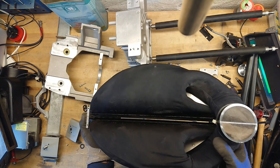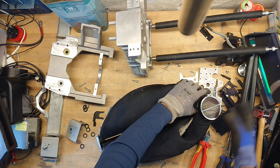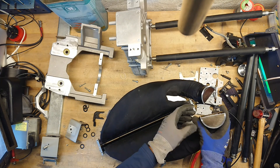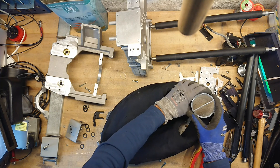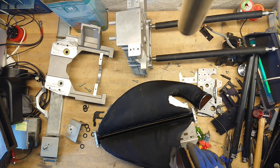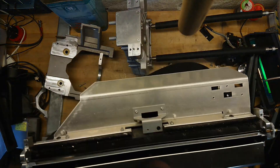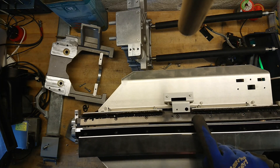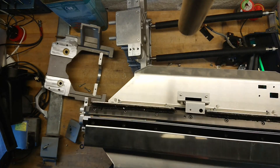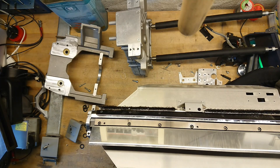The fiber optic unit — we can see it consists actually of two halves here. If I remove this zip tie, I really do not hope that I have fibers springing all over the workshop. But it is made nicely by two encapsulated units that can fit together with these two rods. I guess that makes mounting much easier when you have this in two halves. On the other side of it, here we can see the service brush that was mentioned. Now we can also see down between these two sharp edges the fibers themselves. If I shine some light into it here, we should be able to see them light up — and we can see all the fibers changing.